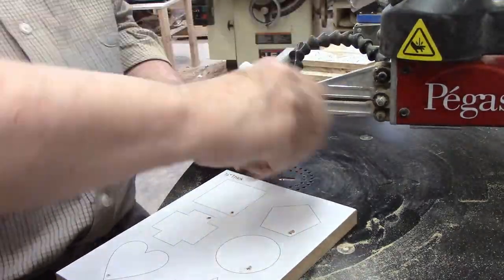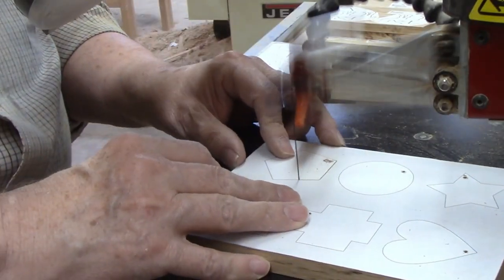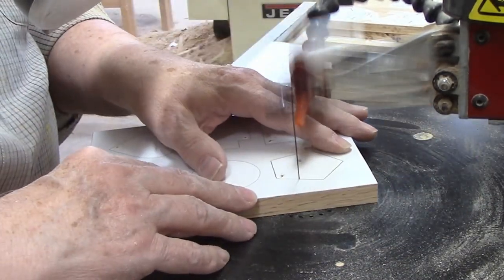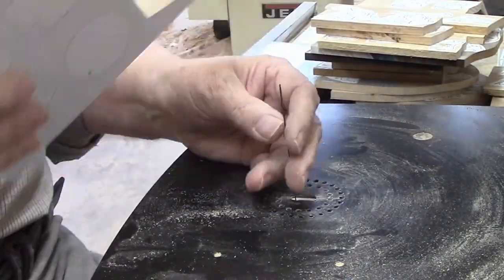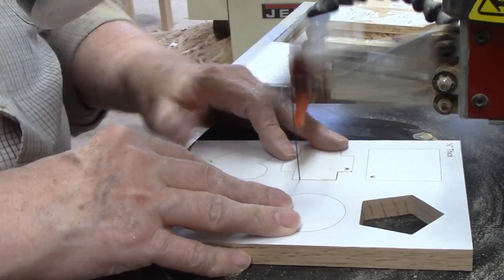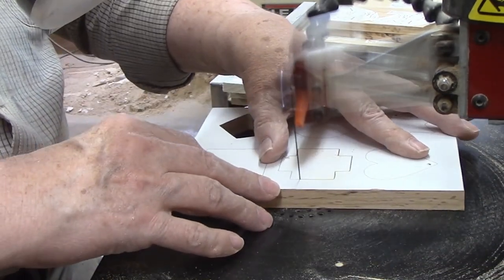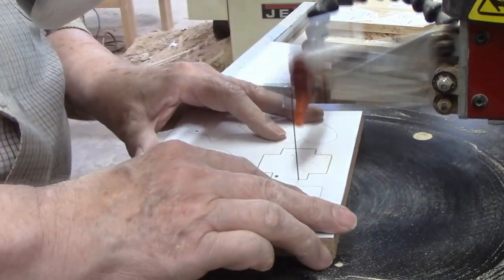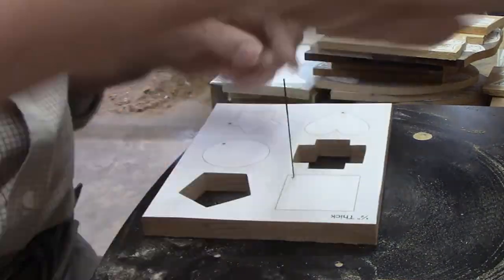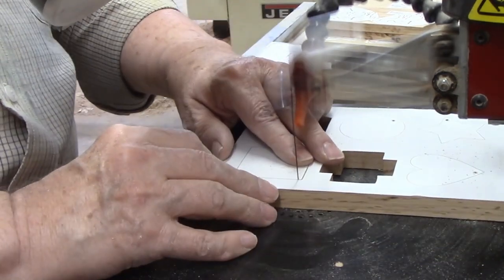While I have the number 7 blade in the saw, I'll continue with the other cuts in the half-inch red oak to make a frame for the geometric shapes. I drilled a pilot hole for each shape; they will be scrap after removed from the frame. The frame is half-inch thick, and the shapes will be cut from one-inch thick stock so they'll be easy to handle. I decided to make the cuts on the outside of the lines to ensure the cutouts are slightly oversized, making it as easy as possible for a child to place each shape in the corresponding opening. These geometric shapes aren't difficult to cut, so this would be a good project for a beginner on the scroll saw — a great place to build skill before tackling projects with lots of small, complicated inside cuts.